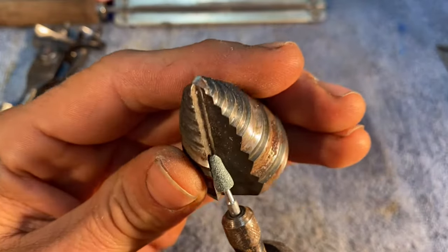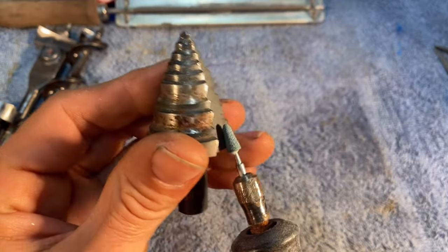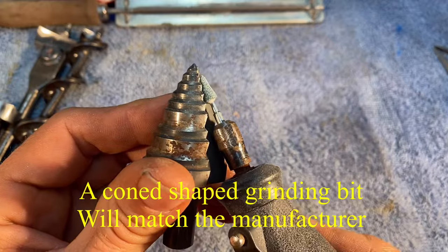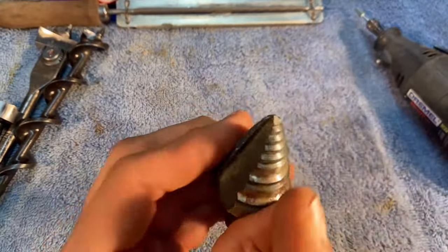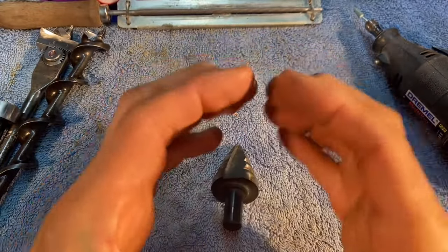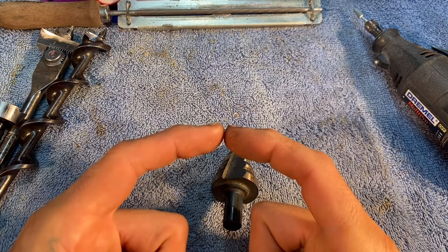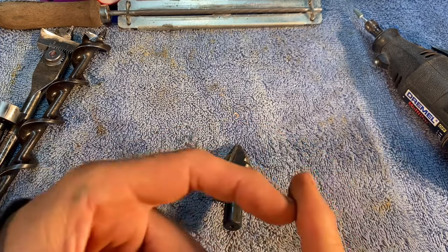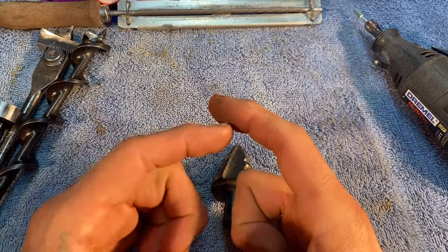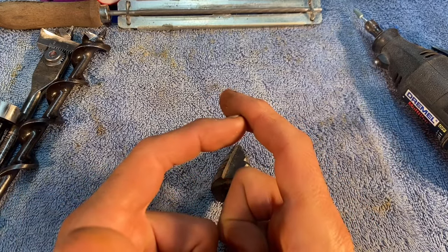Tip it down — if you tip it too far it's like that one. Make sure it just hugs itself up inside of there, and then we're gonna go through and sharpen it. The thing about these is you don't want to take the outside off. Because the outside is round — if the drill bit was shaped like this where it comes around and cuts like that, and the relief portion was like this finger coming around...